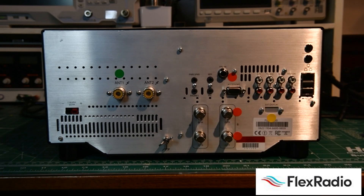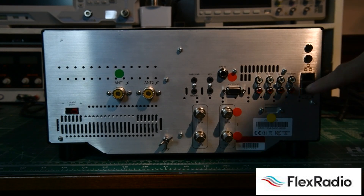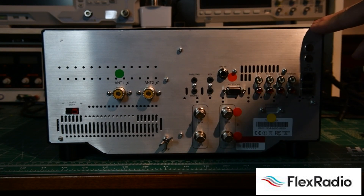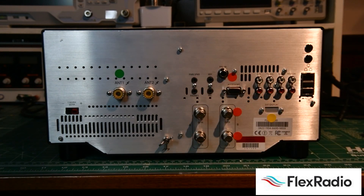With the orange dot: we have the ability to add a balanced microphone input on the 6600, which is really cool. The band isolation goes from about 30-35 dB on the 6400 to almost 55-60 dB on the 6600 — a huge improvement. Pretty much everything else is the same: you can have the GPS DO or 10 MHz input, remote on, et cetera. And if this was a 6600M, you would have a DisplayPort here and an HDMI connector there.